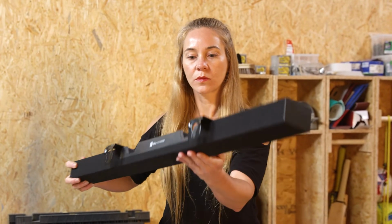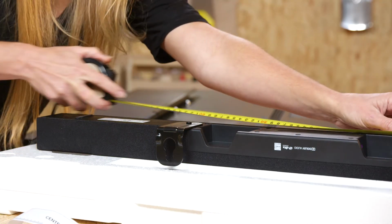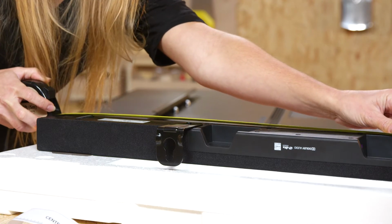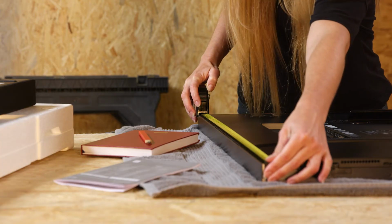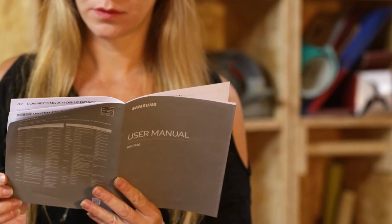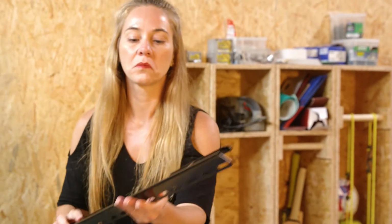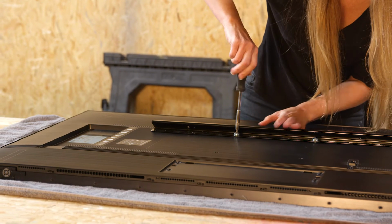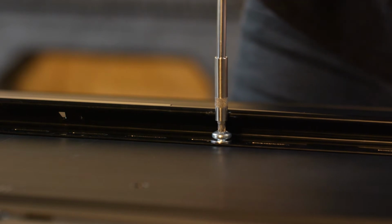This unit is completely bespoke to suit your space and desired setup, so gather all the tech you want to include in your wall of entertainment. You'll need to measure everything, from your TV to your soundbar, and use these measurements as reference points while deciding how big to make your unit. You'll also need to consult the product manuals to find out what kind of wall mounts you'll need, as this can depend on the size and manufacturer, although you may find that some come with their own wall mount included. Be sure to also measure and consider the area in your home where you want to install your unit, so you can make sure that you've got a perfect fit. Sketching out your ideas gives you a great way to visualise your project before you bring it to life.